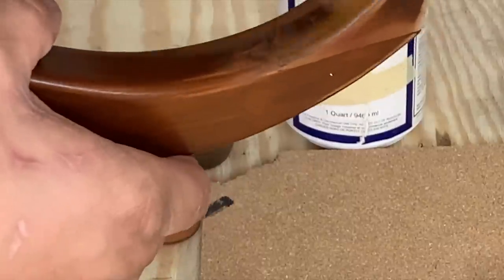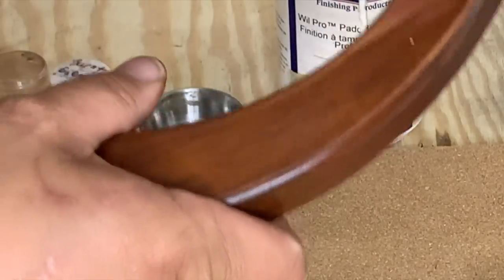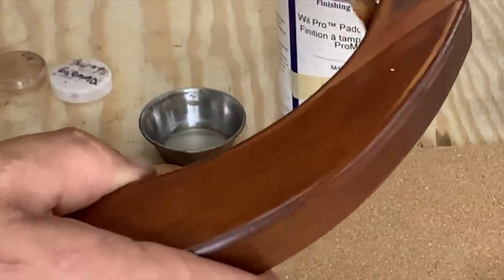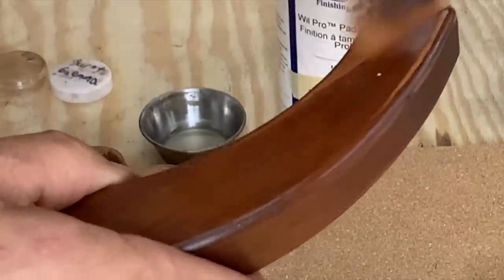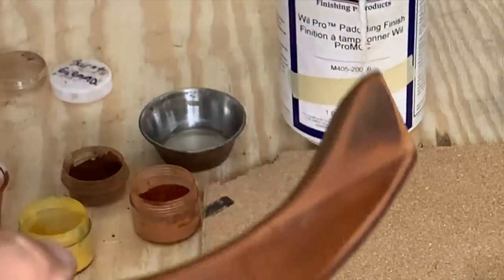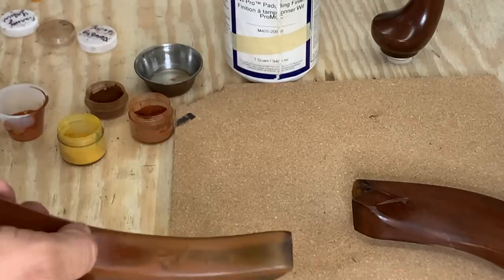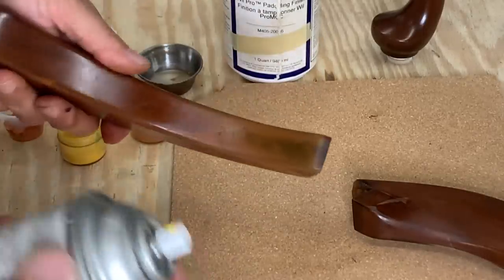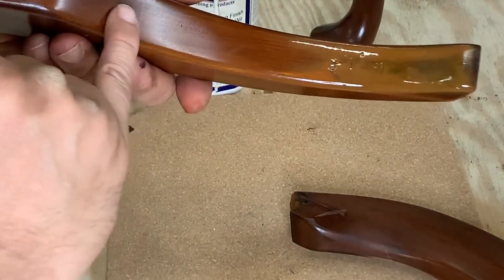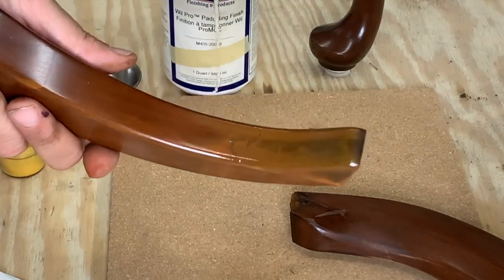So we can do that side — actually we can do all of those. It's one of those things that takes practice. You kind of know what the color that you need is without the lacquer when you get there. You can see there's a lot of yellow in there — it's kind of greenish looking, but we can fix that in post-production. So we'll take our lacquer. What I'm shooting for is the background color, not this foreground red and brown with all the grain. I'm shooting for that color right there in the background behind that, and I think we're pretty close.